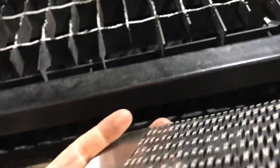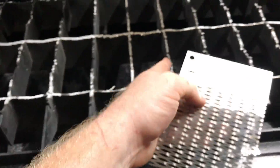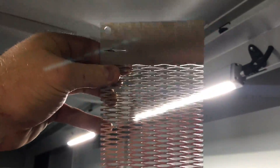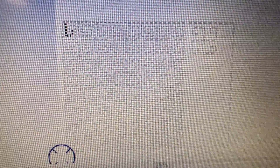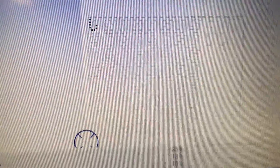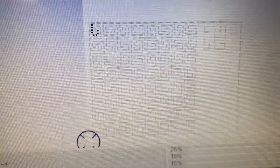Came out pretty good. I was worried about these little pieces dropping through and tipping up when they hit the slats, but that came out pretty nice. So now I'm going to try this fabric pattern, which should give us a 3D living hinge. I don't see any problems with this one because there aren't any small pieces that are going to drop through — it's all straight cuts.